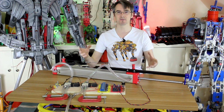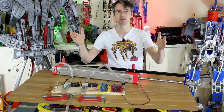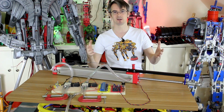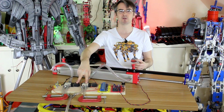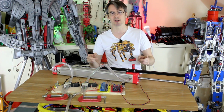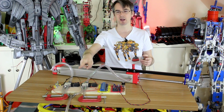The problem with that is that basically we could have different air pressures in those cylinders as we move it up and down and vent them. One will become higher pressure, or at least one will become lower pressure than the other, so that's not ideal as well. So I could scrap this video and go and order a valve, which will take a while to arrive and the video won't be done in time, but actually it might not be a problem, because the next thing I was going to do was try and build a proportional valve to replace those G-clamps.